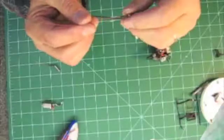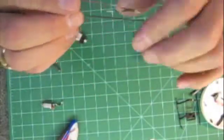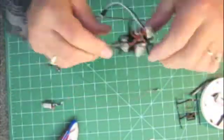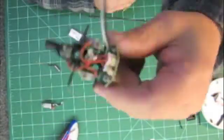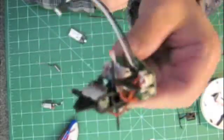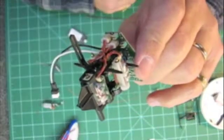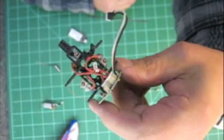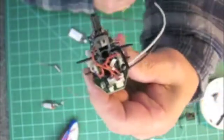Alright? Well, okay, I've soldered on new wires to my tail rotor assembly, green and red. And I put my servos back on, so I discovered that you better keep track because they're all the same. Make sure you mark them. I didn't unplug mine, I just left them plugged in. And then put them back in the spot where I thought they went, and ended up with the right servo on the left side. And anyway, so I switched them back around, so everything's good now.